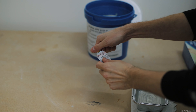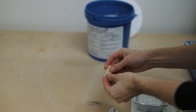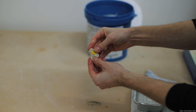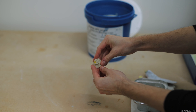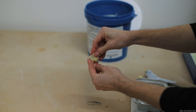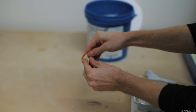Blue Sil RTV3325P and all the alternatives listed are tin-based silicones, which for us simply means they'll set up and cure against pretty much any surface — no sealer needed. They are flexible when it comes to how much catalyzer you put in, and are in general more forgiving and easier to work with compared to platinum-based silicones, which is the other option. However, they don't last as long, but these molds will last us decades, so longevity is not really a concern. If you are interested in more differences between platinum and tin-based silicones, you can look that up on Google — there's plenty of information out there.